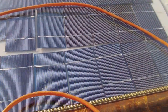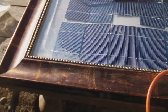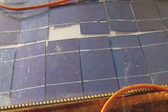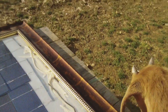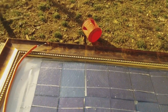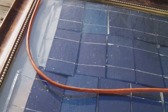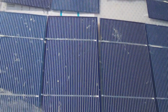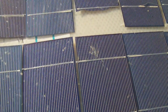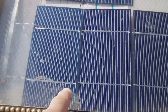What you're seeing here — well, you're seeing my little baby goat get in the way — but you can see this is just a cheap old picture frame. I got it at Big Lots for $30, took out the gross fake art picture, flipped it over and used it for part of the backing. I've taken these Everbright solar cells and soldered them in series. The negative terminal is the front side, the positive on the back.